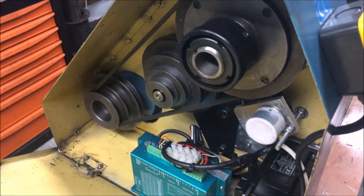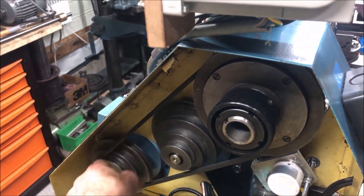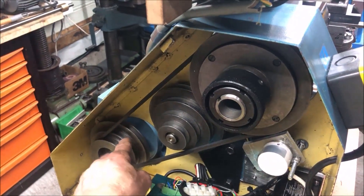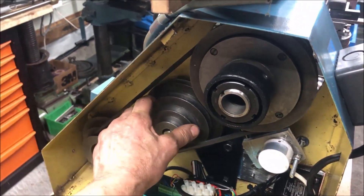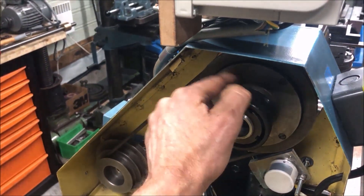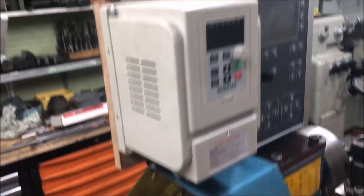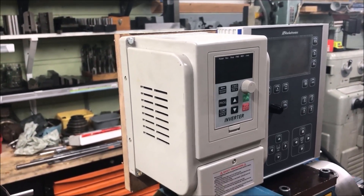The drive system is a bit special. You have two possible belt configurations: a long belt for the three upper speeds, and then using the intermediate shaft with two belts. Although this gives speeds down to 160 RPM, I'm not entirely happy with this setup, so I'm going to change it to a Milford Mistro 5-step pulley with a PolyV belt section, and also change out the motor to a 6-pole, which gives more low-end torque — hopefully omitting the intermediate pulley stage.